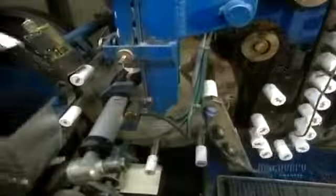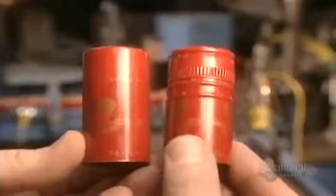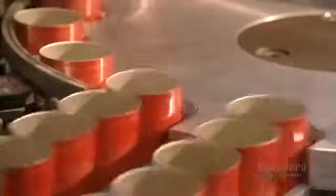This other flexographic type of decorator prints 155 caps a minute. Here we can clearly see the ink roller which imprints the side of the caps as they rotate against it in a steady stream. All that's required now is to form the cap and make the cut. The profiling and jointing machine makes the cuts and reliefs on 200 caps per minute.